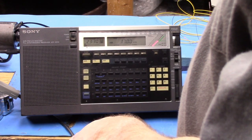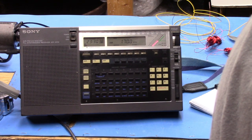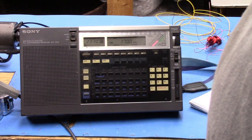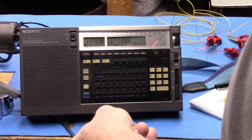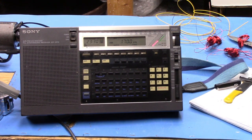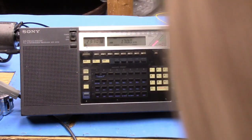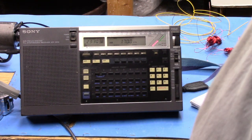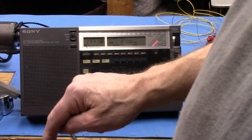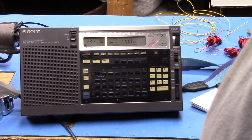You know, if this is 750 picofarads, where we started off, adding another 900 or so is going to take you way below. So, with a full set of turns, this variable capacitor, and this guy right here, this would probably take you down to roughly 100 kilohertz. So perfectly usable for the long wave bands. If you used more capacitance, it'd get you down even lower. The tuning range of the capacitor is going to be very limited when you put in the fixed capacitance.